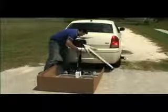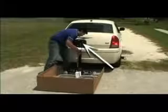Raise the lift to the upright position by grasping the outer tube and align the lift with the hitch adapter. Make sure never to lift from the plastic motor box cover, as this may cause damage to your lift. Insert the key and turn it to the on position. Power the lift down — this will raise the hitch post into the hitch adapter. Continue until the bolt holes are aligned, then insert two bolts and tighten.